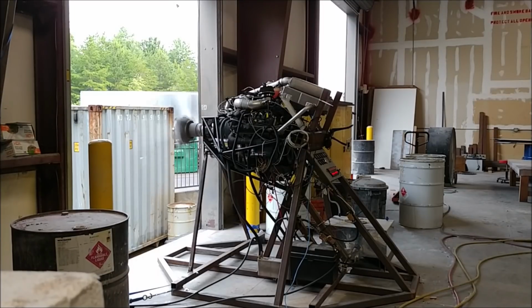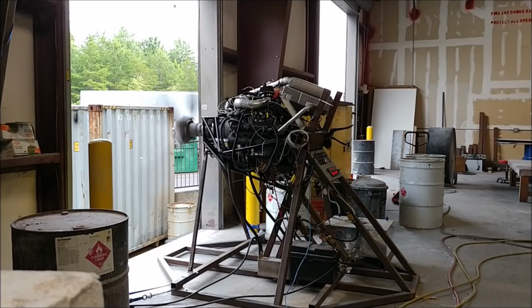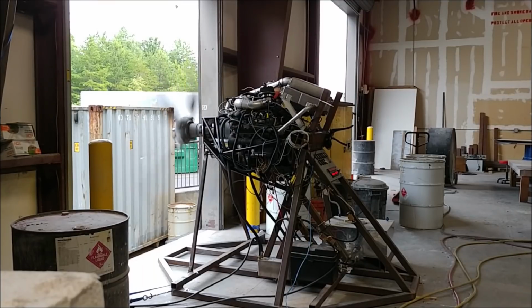This time I really pushed it up to sort of max power settings, and I was really keeping an eye on the EGTs. I didn't want to get it much higher than about 1300 degrees Fahrenheit. So that's what I was watching for, and I'll show you in a second the output of this. But everything ran super smooth on there. I didn't have any problems, and you'll see in a second there, got it over 3800 RPM, which was the goal. And the fuel burn was just over 16 gallons an hour, which is really actually good.